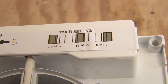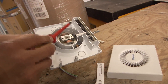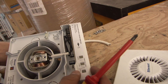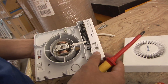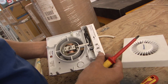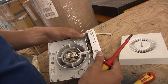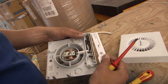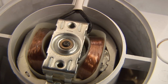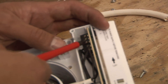We'll just take a closer look. Just pop it off there. You'll see there's the three connections that line up. What you'll do is wire this from a light switch, break it through a fan isolation switch outside the bathroom — it's part of the regulations — then take the switched live which comes from the light switch to this first connection, and you'll have your neutral in the middle, which obviously allows it to work.